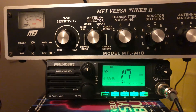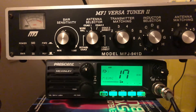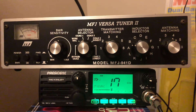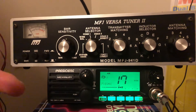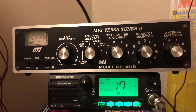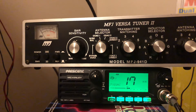If you're close enough in frequency, you might not have to retune. But if you're jumping from channel 6 all the way up to 38 lower, you may have to adjust — especially if you're using a random wire or something you built and you're not sure the SWRs are good. This is a handy thing to have. The VersaTuner 2 also has a newer model with an X meter. This one is rated up to 300 watts. It has forward and reflected power, a power meter, and an SWR meter.